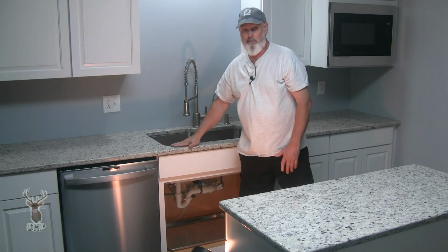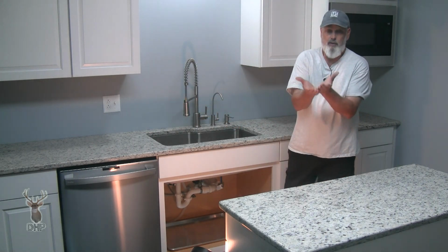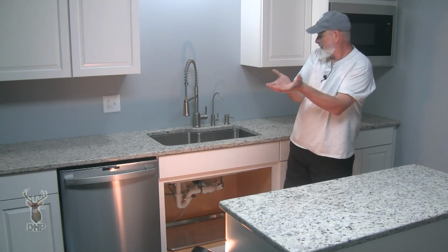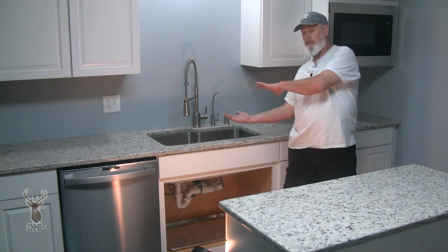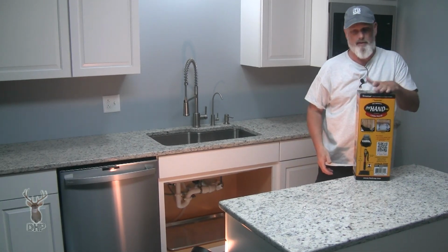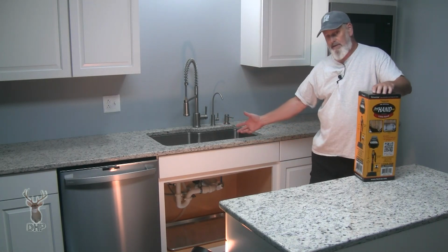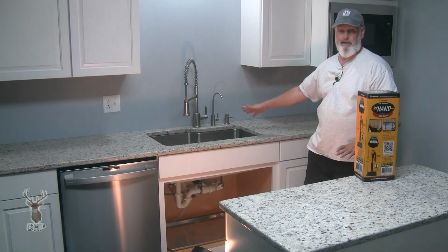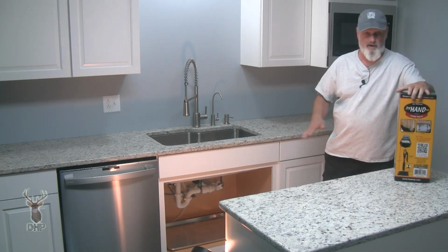So, how we did it was we did in fact run a bead of silicone around it. That will act both as a glue or a way to hold it, a vibration, rough surface type of adhesive. It has pretty good grip actually, silicone does. I don't think I would depend on it by itself. But we put that around there, slid it in there at a little bit of angle, rising in position, and then took our third hand. This is the little one, and what it allowed me to do is to get that into place, raise it up just enough to hold it while we put the other ledger in and bolted it down. Then at that point in time, it could rest on the ledgers on those edges that we had and still let that silicone dry.